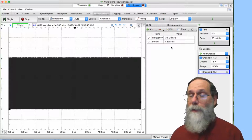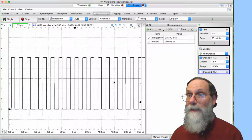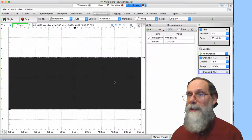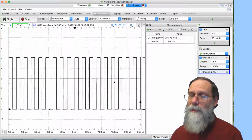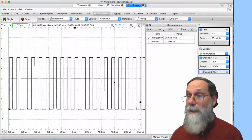Okay, so frequency here is very high. I can't really see it. It's looking like solid black. But if I touch the touch panel, now I'm taking it down to about 33 kilohertz. So that's an enormous change in frequency. And you can see it's still fluctuating, and that's because there's 60 hertz noise being coupled in here, which causes modulation of the frequency.